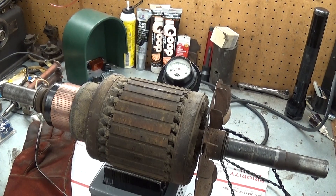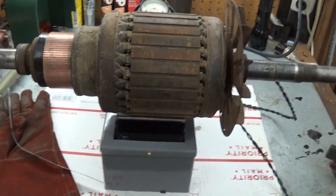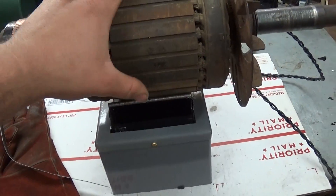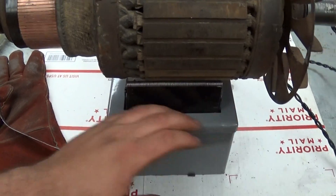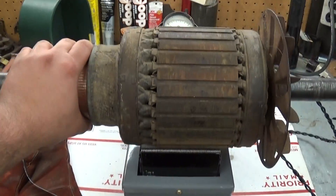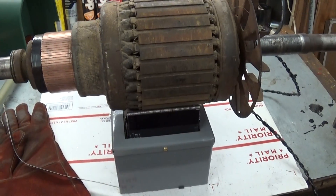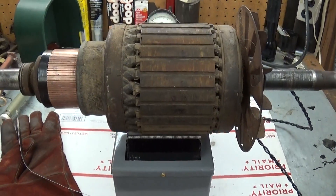It's not much use now, but its common use was in the automotive industry where you had an actual DC generator to maintain battery charge, back in the earlier days. And it would see some use in industrial service like in a big generator like this one. Most automotive shops would have had one. Of course, the testing can be done by other means with a meter and some other tools, but this was just a real handy way of doing it. It's real simple — pop the armature out, set it on the machine, and energize it. You can get a quick assessment of the piece.